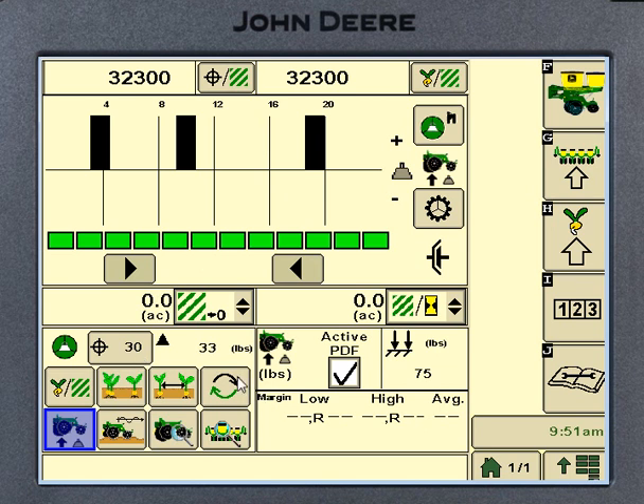The same applies to any of these pages: if we're seeing the alarm go one way all the time and not the other, we have to tweak that baseline — the center line. Change it to where we're seeing it go a little sometimes below and sometimes above, then set the sensitivity of what it takes to trigger the alarm.